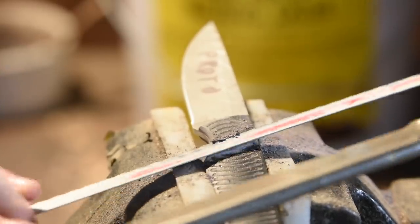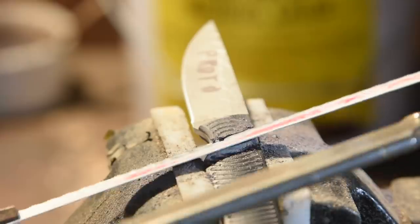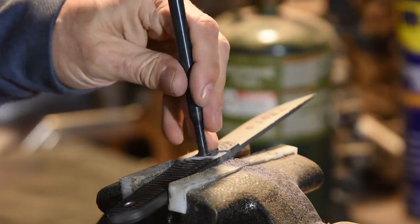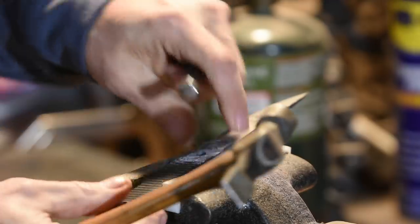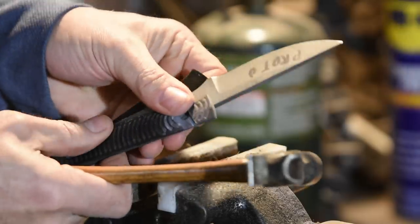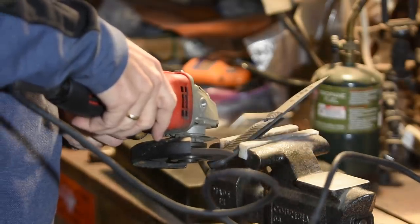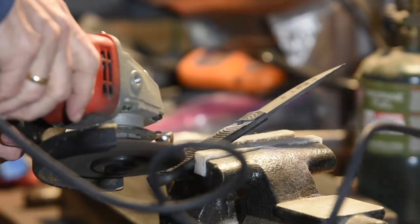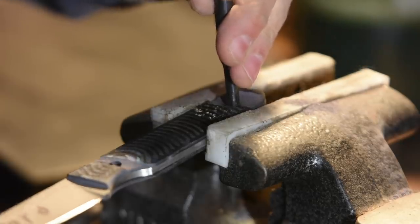This little sliver right here is the top of the rivet — that's all you need to get it off. After you've gone all the way through, you'll need a punch to knock it out the other side. You can find punch sets at any big-box hardware store, but you can improvise one out of an old bolt if you don't have one. Or here's a slightly quicker alternative: if you have an angle grinder, just grind the head off. In either case, just go easy so you don't grind into the knife.